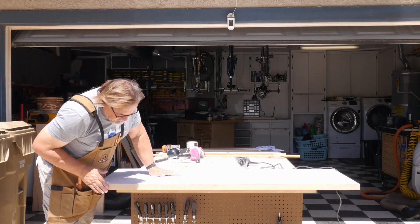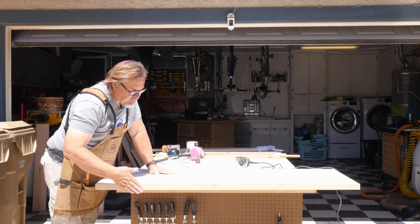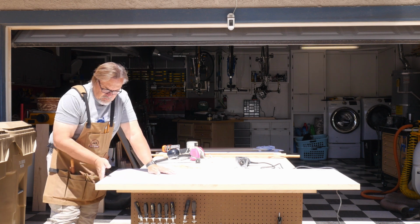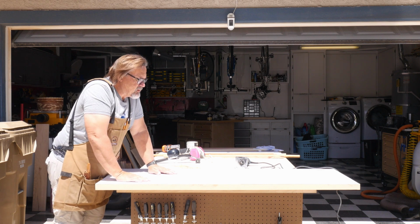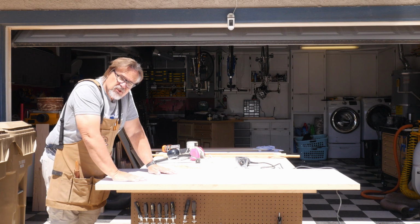So what I'm gonna do is use this piece of sandpaper, go across this edge just to make sure everything's smooth. Then I'm gonna glue on a piece of Formica onto here, and then onto here. Well, first put glue on here, trim it up, and then glue it onto here and trim it up. And then this countertop will be done. I'll just put a little bull nose right across here, which I'll show you in a minute.